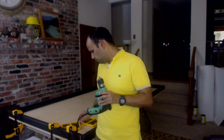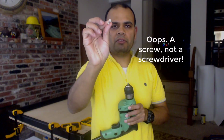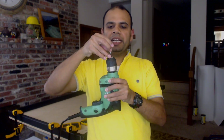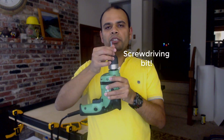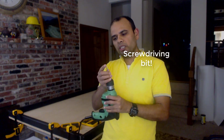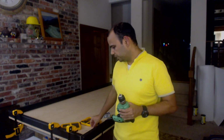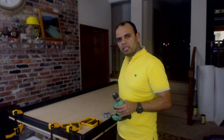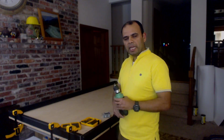At this point, take your screw. Your screw has this square kind of Phillips cut over here. You can fit it on top of your drill bit. There you go. Then, at the pilot hole that you had, put the screw right at the edge, at the entrance of that hole, and screw it in. And that's all there is, really. Two 8-feet length studs, two 45-inch studs, and a flat piece of plywood, and drilling from the bottom.